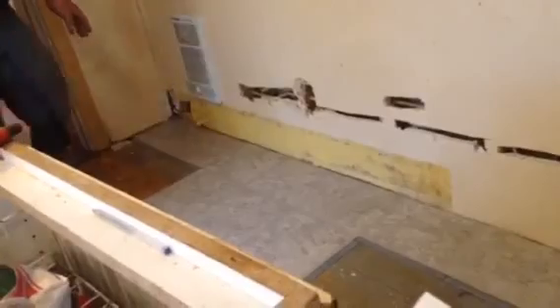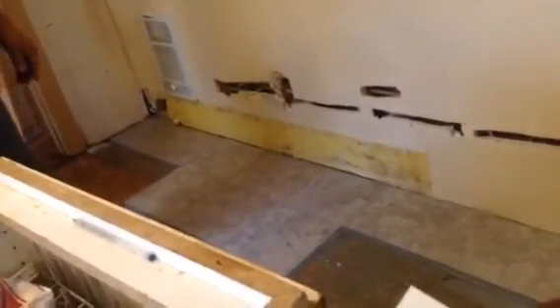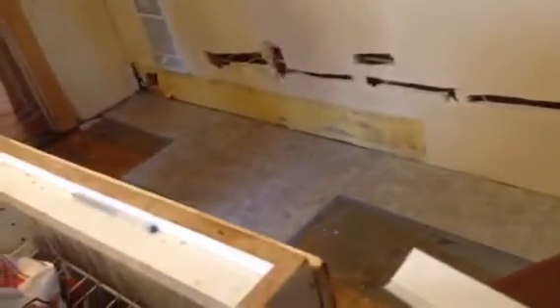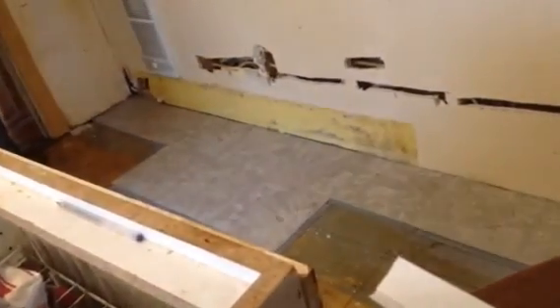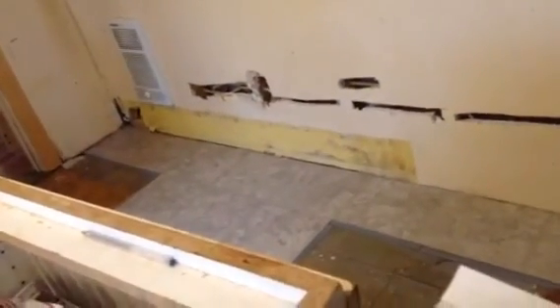Dale says the trick is never to be in a hurry when you're doing this. Words of wisdom. Patience. As you can see as I'm doing the floor, I don't start at the end — I'll start here, and then I'll make two cuts down on each end. He's alternating them so there's no great seam down the middle. It's a three-tile-wide piece. He didn't start at the beginning so that, in case the walls are not square — which of course they're not — it works out.